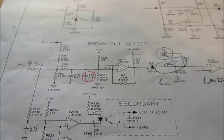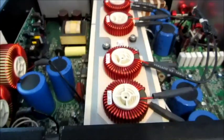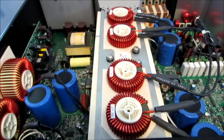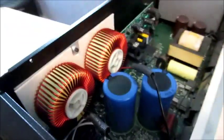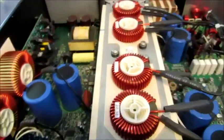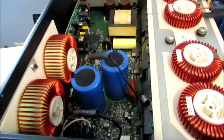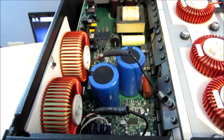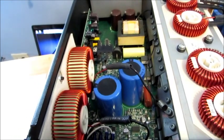quite positive. So just a couple of words of caution about this amplifier and its power supply. The way that this works is actually pretty simple. You want to get power factor correction, and the way that you do that is you always draw current from the AC line. So the way that this does this is it boosts up the rectified AC voltage to 400 volts DC. And the way it does that is it shorts this big inductor here to ground many thousands of times per second to charge it up, and when the inductor shorted to ground is switched open, it charges up these big caps here, which collect a very large voltage change. Because remember, according to Lenz's law, you cannot have current change instantaneously through an inductor without developing a very high voltage across it. So that concept is exploited in a DC to DC booster.